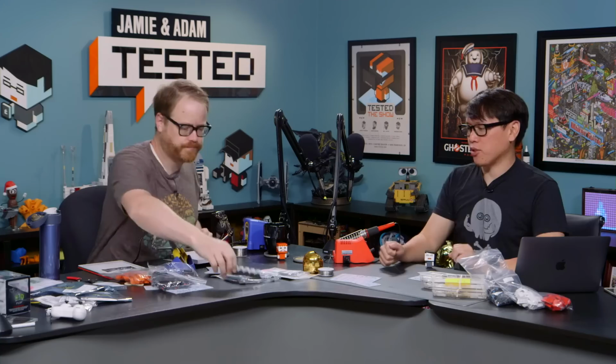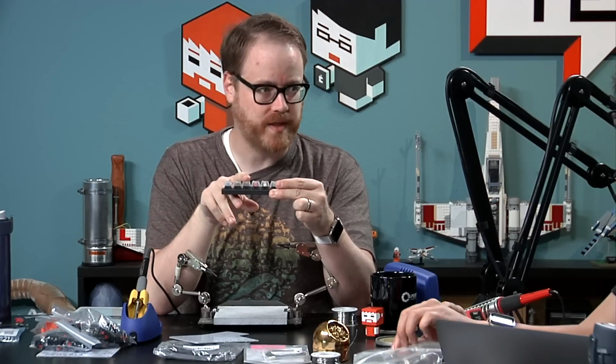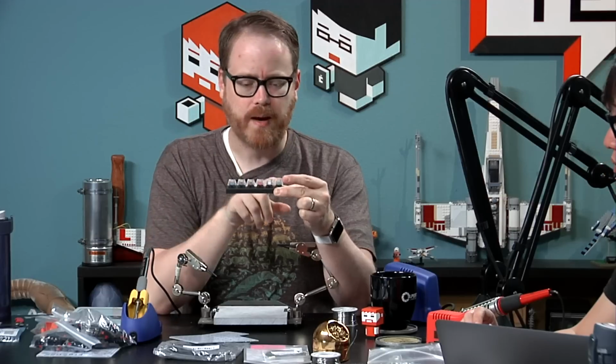So let's talk about mechanical key switches. There's a ton of different mechanical key switches on mechanical keyboards. The most popular are the Cherry MX switches, and they come in a variety of colors, and the colors basically indicate the key behavior. So the color means nothing other than it indicates, hey, this switch does have a bump that tells you when it's actuated, and it releases at the same space it's actuated. This one actuates lower than it releases, and it doesn't have a bump, et cetera. Actuates lower meaning you have to press further down before the key indicates it's pressed, and it releases earlier or whatever.